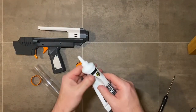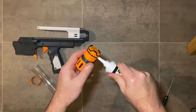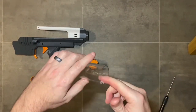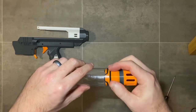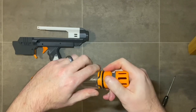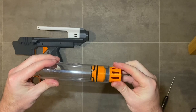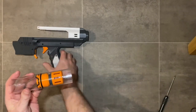Apply silicone grease to the rear O-ring specifically — that's the one creating the seal in the plunger tube. Also apply silicone to the inside of the plunger tube, put a couple of blobs in and smear it around. It can be a little difficult to get the O-rings seated into the plunger tube — you want the seal to be tight but not too draggy. Push it in, massage it around, encourage any parts that won't go in. Once it goes in you should see a bead of grease around the tube — but it should still be free and fast to move.